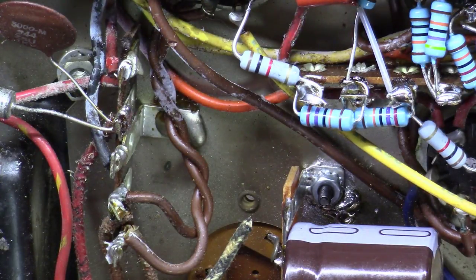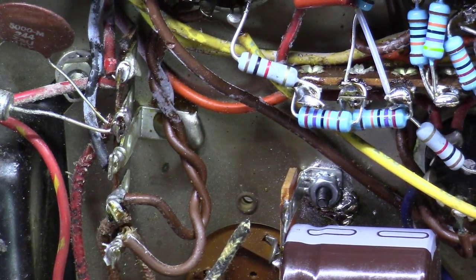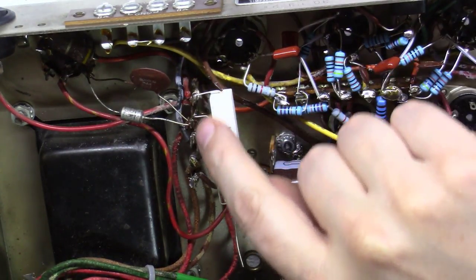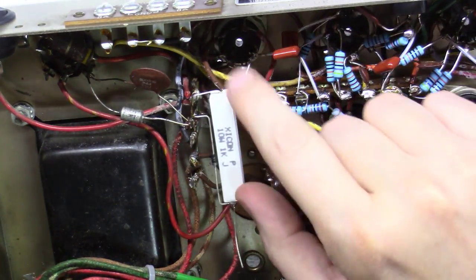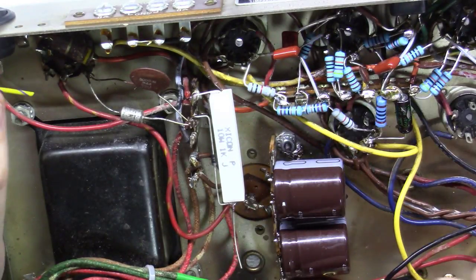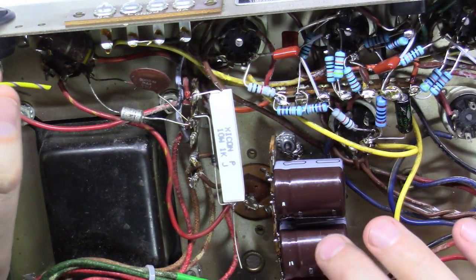Much harder if you try to do it without some new fresh solder on it. Okay, as you can see, I soldered the resistor in here coming off of this lead. The diode, kind of brought it over, tagged it onto the side of that. But I still got to get this resistor tied down here to the same point as these others.